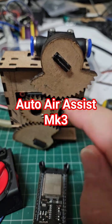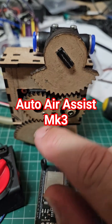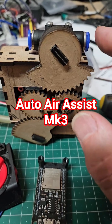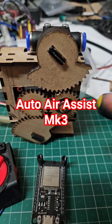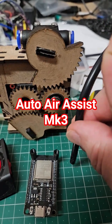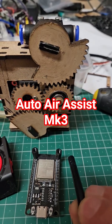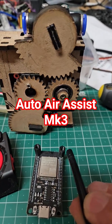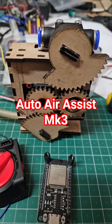This one will be fully open, or we can adjust where these gears mesh to get a different ratio between fully open and fully closed. What I'm thinking is we can use the air coming out of here — when you're not calling for air, this will be fully open and this will just be trickling. I'm thinking of getting another air pipe, not going straight down like the nozzle does, but pushing air at an angle underneath the diode laser, blowing more air than your extract fan would be sucking, to try and clear any debris when you're engraving — especially when engraving slate.